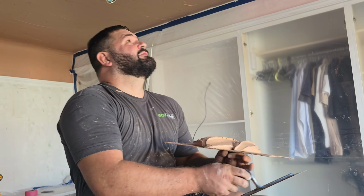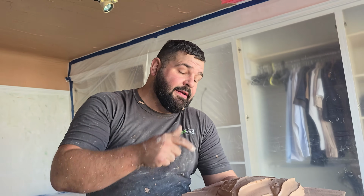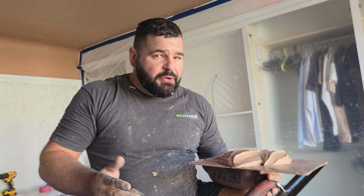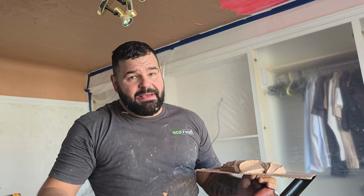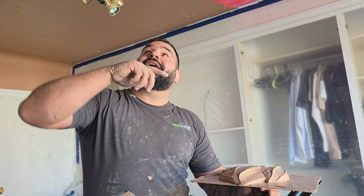There's a few different ways of getting over an Artex pattern. Some fellas like to float it out first with a coat of bonding, and some guys like to do what we call a magic mix, where they mix bonding coat, which is a lightweight backing coat plaster, with the first coat of finish, so it thickens it up quite a bit. The thing with plastering is, there's loads of ways of doing everything, and it doesn't mean that anyone's wrong, it's just that there's different ways of doing it. I've tried them all. This is just the way I prefer because it's less materials and less messing around, and I think it's a little bit faster. But if you're not bothered about an extra half an hour or an hour on the mix, then you could mix bonding in, and you might find it covers the pattern slightly easier. Whereas for me, it doesn't really. I'm not bothered.